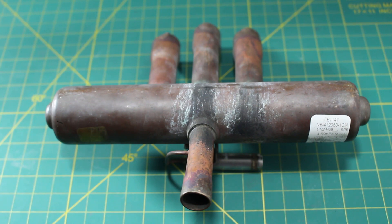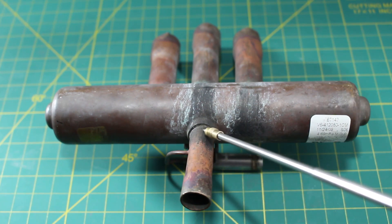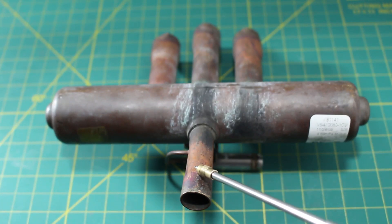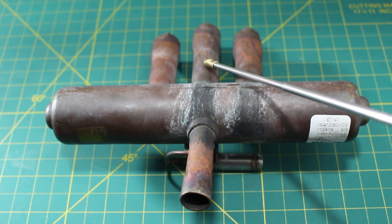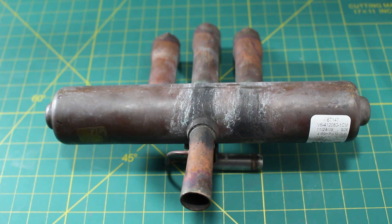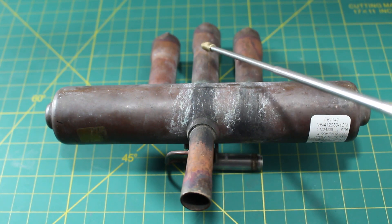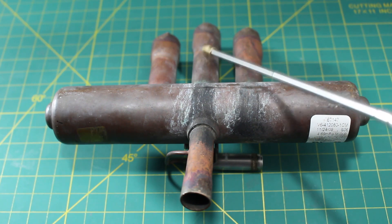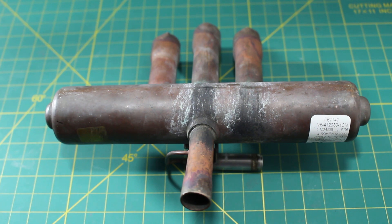Here's a look at our four-way reversing valve one last time. Two things remain constant, always. The pipe entering our four-way reversing valve is always our discharge line — this is leaving our compressor. The middle port is our suction line, and always returns back to the compressor. We enter the discharge line as a high-pressure, high-temperature, superheated vapor, and we always return to the compressor as a low-temperature, low-pressure, superheated vapor. A compressor is also known as a vapor pump — if any liquid gets in the compressor, well, you can say goodbye to that.